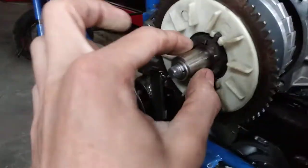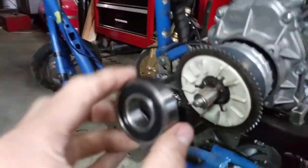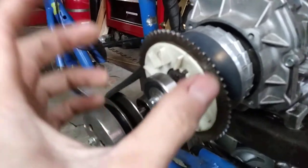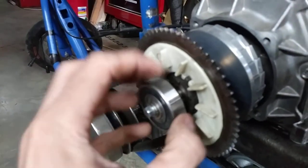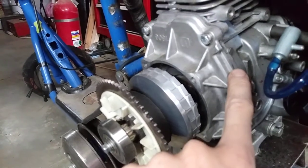Me and my buddy made this little piece here back when we made this adapter back in February, to take a bearing. Let me grab a bearing real quick and demonstrate. There should be a bearing right in here somewhere — there's some bearings, I'll just pull one out. This slides onto this right here — very, very snug fit. So it'll have a bearing right here. My buddy has a piece of pipe that he's already turned down in the lathe to slide over this, and this is going to be an extra support for this whole assembly to take the strain off of the crank bearing right here.